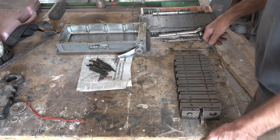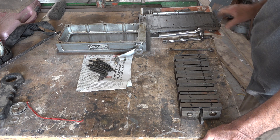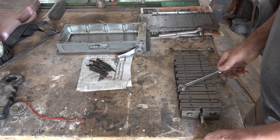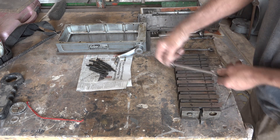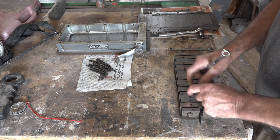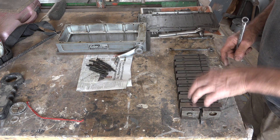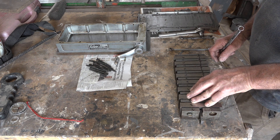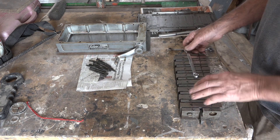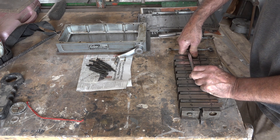We're gathered here today around an Eclipse magnetic chuck which has seen better days. The magnetism is just not up to par on this magnet, so if I'm surface grinding a really thin piece of steel, say 4mm, the magnetism is really weak on that end. You can kind of push a thin piece of steel around on it - it's better on one end, not as good on the other.